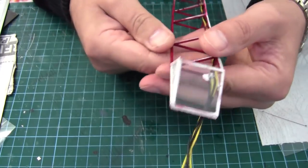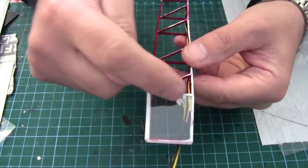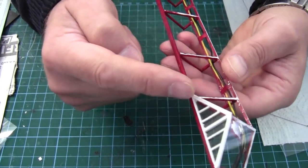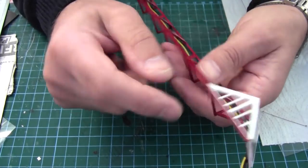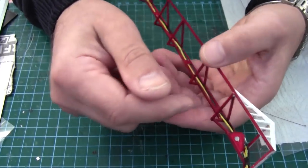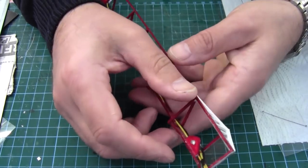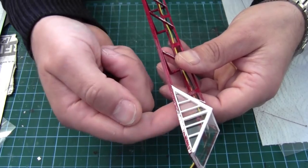The paint has dried overnight, and as you can see, I've made a good start on the glazing. This was just a quite easy square piece to fit, but the triangle, if you like, inside there was a little bit more trickier. We had to measure the width, cut a strip at 20mm, and then notch out for the frame on the top there and square up both ends, because the outside dimension is 4mm shorter than the inside dimension.